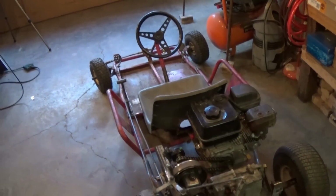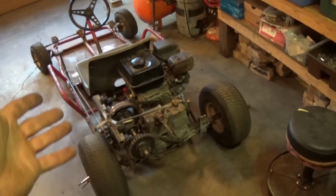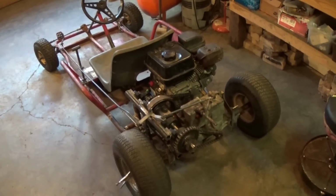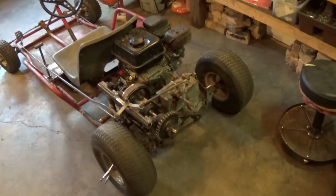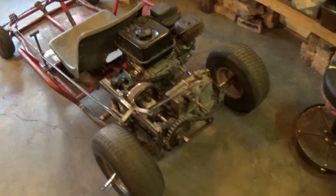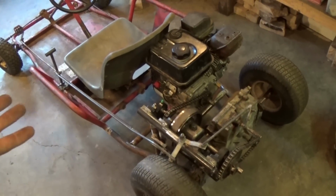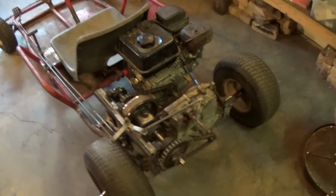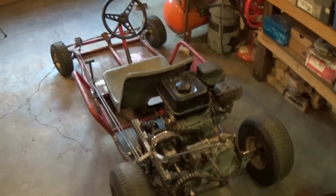But like I said, I do have to floor the engine just so it can accelerate without killing the motor. But at least it accelerates. At least it works. The clutch works. The motor does not have enough power to get this thing going, unfortunately. I would love to get a bigger motor and put it on here, but I don't think I have one, and I don't have the funds right now to go buy one. I have thought about possibly putting a torque converter on here, but if I did that, it would defeat the purpose of having this differential clutch. The only reason I really built this thing is just to see if the differential clutch would actually work or not. So if it works, I'm happy. If the motor doesn't have enough power, so be it. Really, I'm not going to be riding this thing a lot.